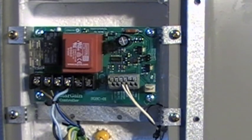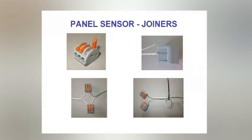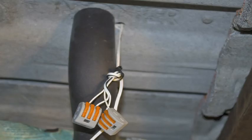These two short flashes indicate a sensor fault. These are the joiners for joining the short sensor lead in the ceiling space from the panels to the long sensor lead brought up from the tank below. Two joiners must be used, not one.